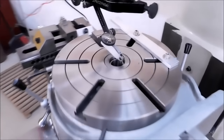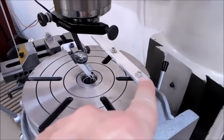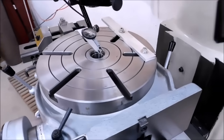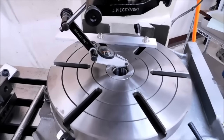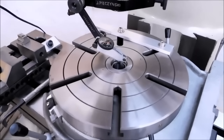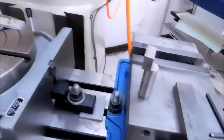That being said, the rotary table is securely mounted to the table and I have a fence on my rotary table that is indicated true in line with the X-axis. That just helps establish what's going on and is a little bit easier for future setups. Let me mount this to a tripod and I will show you exactly how fast you can make a feature with this new little alignment pin — works pretty good.